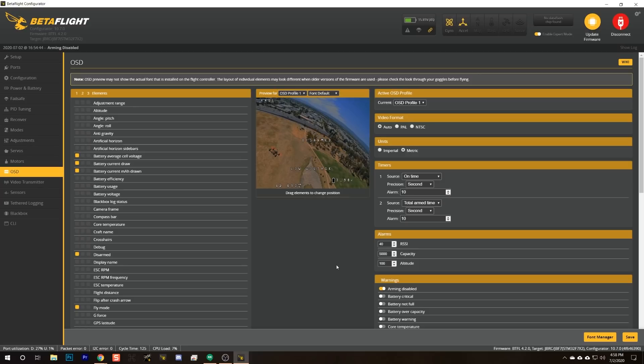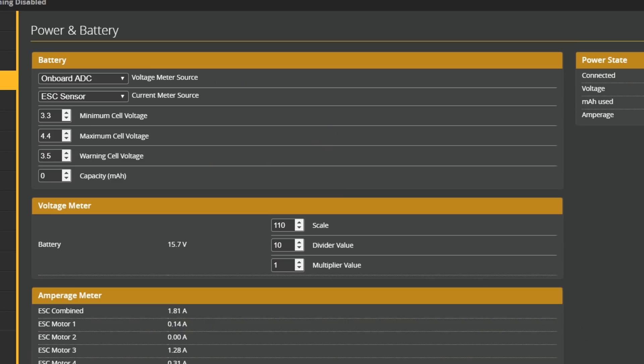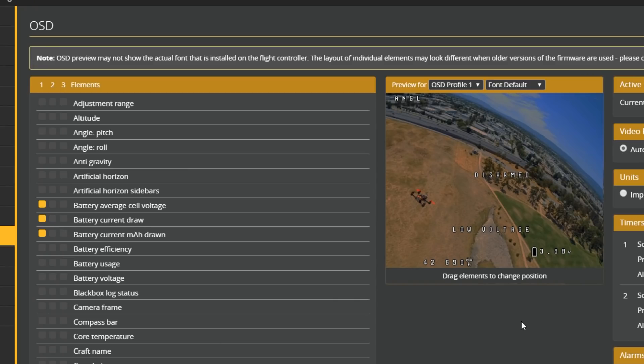You may have already experienced something like this in the Betaflight OSD tab, where you can have average cell voltage and battery voltage turned on — one or the other, or both. I actually like to have both turned on on most of my quads. The reason is that sometimes Betaflight gets the battery cell count wrong. The way Betaflight knows how many cells your battery has is by looking at the pack voltage and dividing it by the maximum cell voltage. And that's why I like to have both displayed — so I can sanity check that Betaflight is calculating the cell voltage correctly.